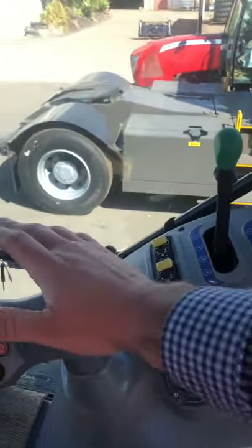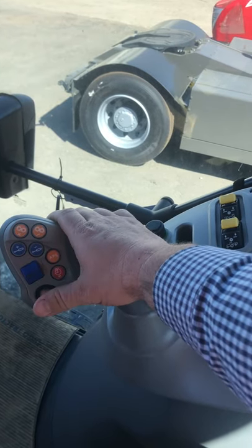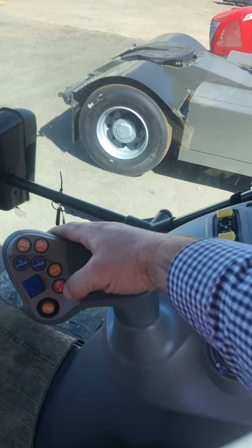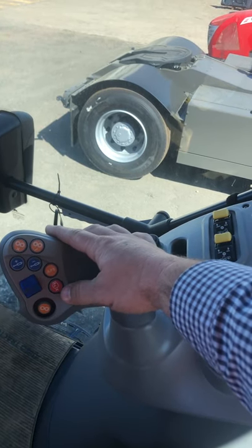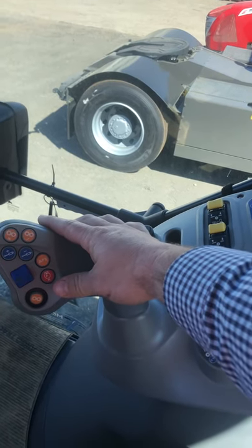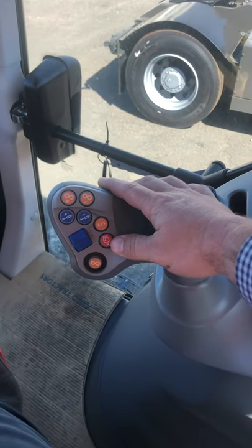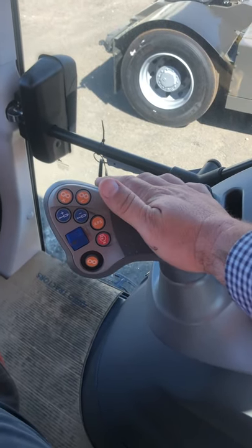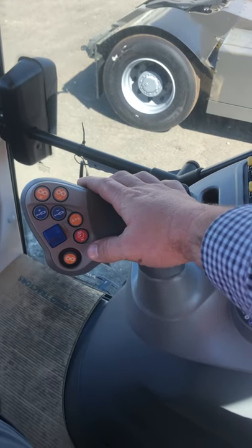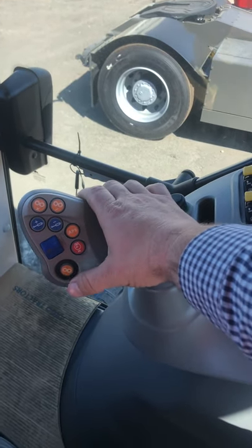On the main power control, we can control our raise and lower and our first set of hydraulics at the rear. We can actually store an engine rev — so if we want to set a 540 PTO speed at 2,200 RPM, we set our revs on the foot throttle and store that speed in the engine memory. We have an auto power shift mode to change through auto, manual, and field modes, and even a de-clutch button.